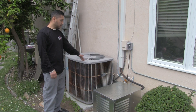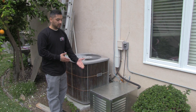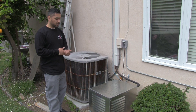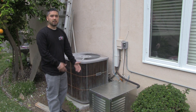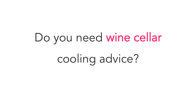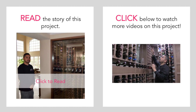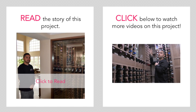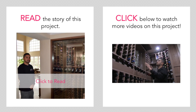There's a box to protect the condensing unit from outside elements — rain, debris, whatever. Unlike an air conditioning unit, refrigeration condensing units like this one are designed for interior spaces. So if you're going to place it outdoors, you want to protect it, and we've added this cover because we knew it was going to be outside, so it will be able to protect it.